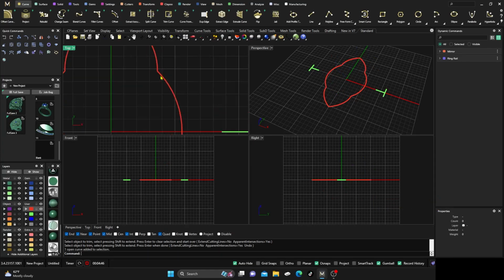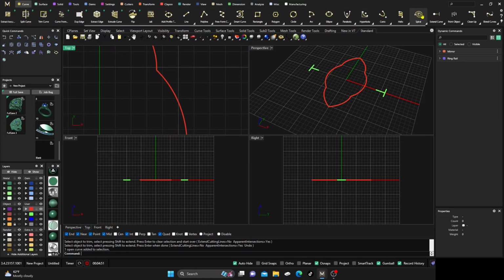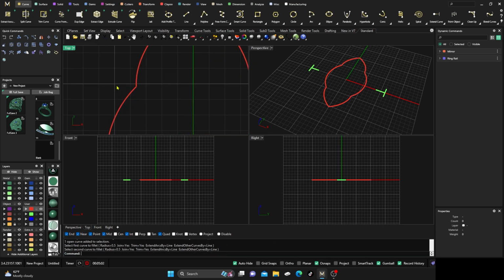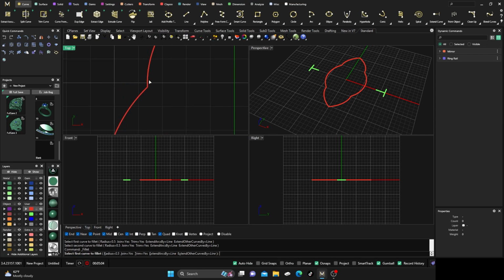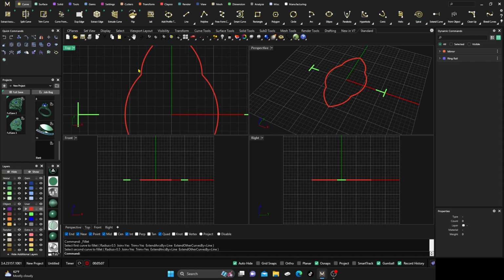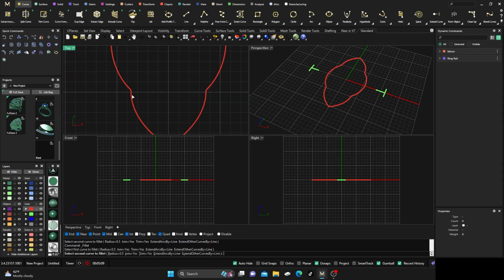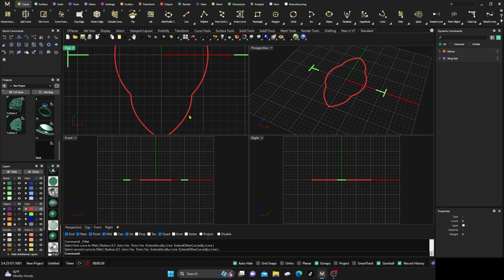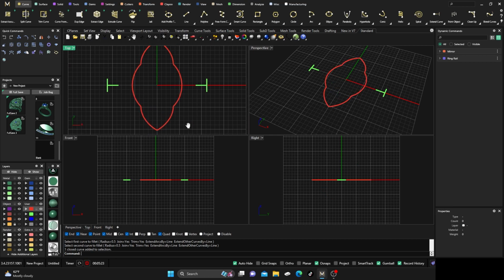We're going to want to make those a little bit fillet on there. So we'll scroll down here to our cleanup, and we'll just select the top one there. I have it set at 0.5, so that should be fine. I'll select this curve, and it gives me a little fillet there. And I'll go to this one, bring back that command, right click, select that one, and then I'll do the same, right click, bring back this one, and right click. And I have join set to yes and trim set to yes, so it'll automatically do all that for me. Select this curve, and there. Now we have the one curve right there, right?